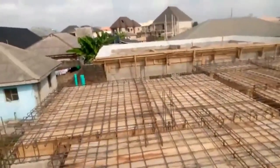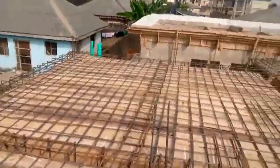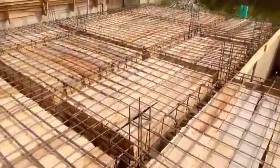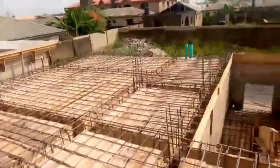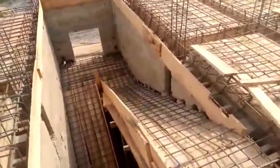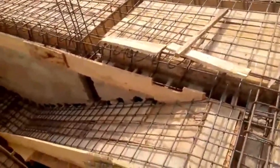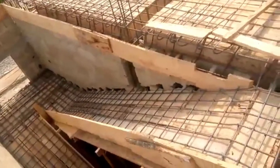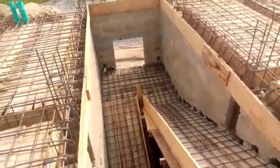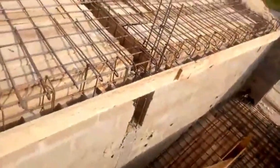all the walls surrounding the building, you get all huge, big columns that is the strength of the decking. They're going to the steps as well. Look at it. That's the step. The concrete will be poured into this. You could see that there's a beam holding the landing of the steps here. Just to give you the structural aspect of the construction.